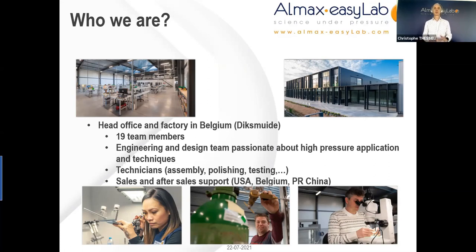We also provide a wide range of accessories to work with high pressures at low, room, and high temperatures. This complementarity really enables us to design diamond anvil cells specific to a given application. As often, the design of a diamond anvil cell starts from the diamond itself, and then the supporting geometry is dictated by constraints such as collection angle, space, and dimension constraints. We can then design the diamond anvil cell accordingly and make tests with various diamond anvil geometries. The fact we can do that in-house is a big advantage.